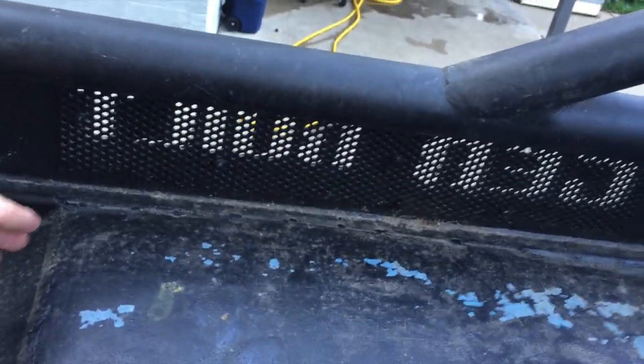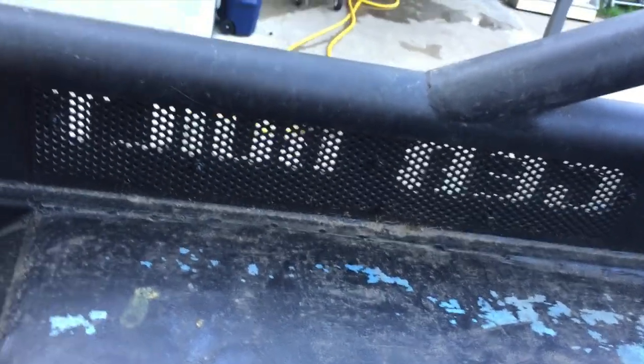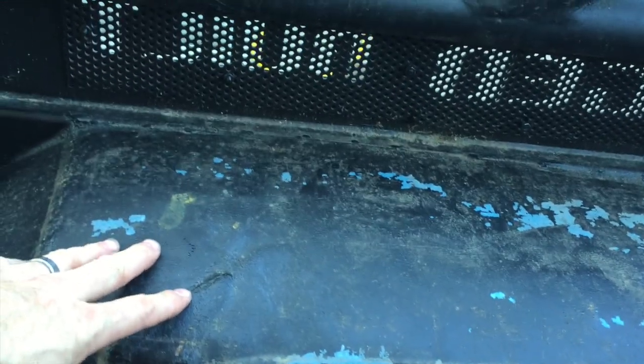Then the rear fender wells. Obviously I had to trim those down on the outside edge by the same, well, it was a little more than 3 inches because my rectangle tubing is 2 inches wide, so I probably cut down approximately 5 inches off of them. And then to get a little more low profile look, I basically decapitated them, and then I flattened out the top that I cut off, and then re-welded it all the way around back onto the top of the inner fender well there. They're not perfect. They were all dented up anyway. I just made them work. They're good and strong though, and a little lower profile, which is what I wanted.